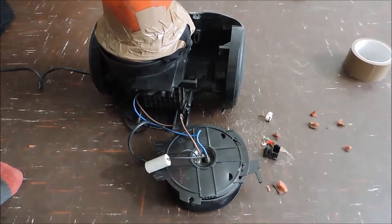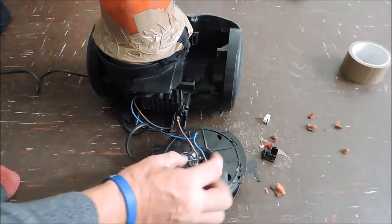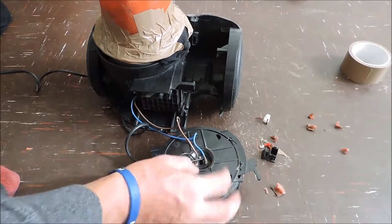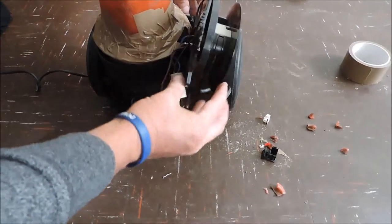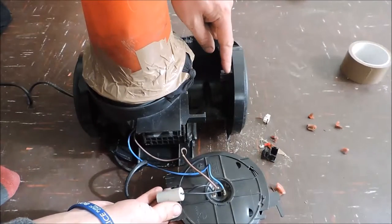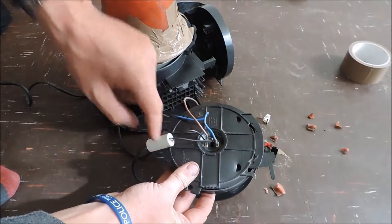As I've decided to keep the winding case, we have these exposed wires going into it, so we need some way of covering those for safety so that they don't cross. We have a space here in the wheel casing and this would fit neatly in there, so we can just hacksaw this bit off and fit it in and put a covering of some sort over these wires.